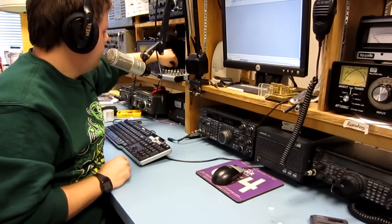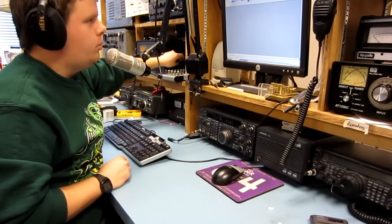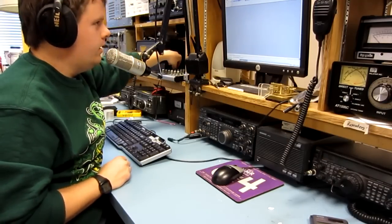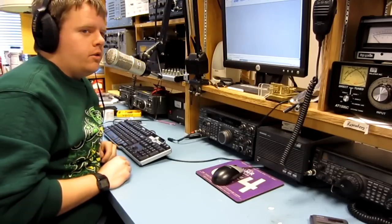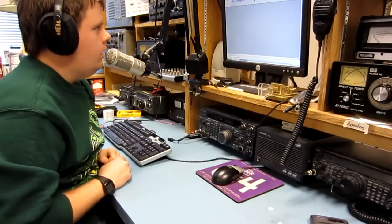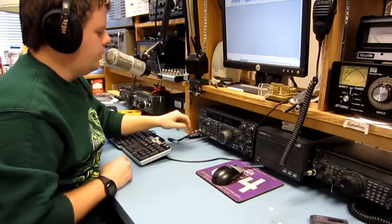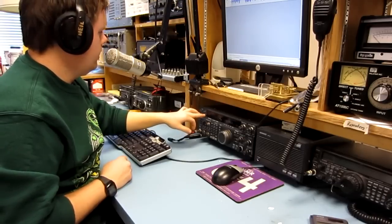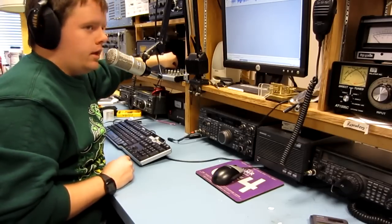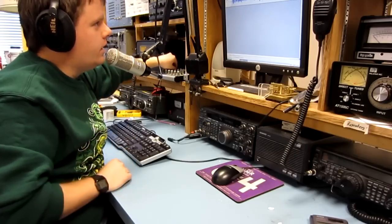This is with 80 hertz all the way high. We'll put that back in the middle there. Now we're going to play with 2.5 kilohertz. This is where the DXing comes into play. I'm going to crank it. This is 2.5 kilohertz cranked. Imagine me on an island calling CQ, CQ. This is the sound I would want my microphone to make into the radio, along with a processor or a high boost like this thing has. I just cracked my voice. You would play with the middle here. You crank it up to where you can get the articulation sound of the voice there.